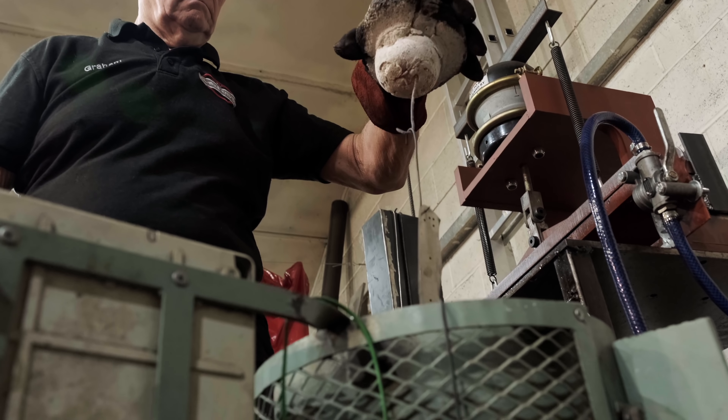To stress relieve, you heat the metal up to below that critical point, all the stresses relieve themselves, and it cools down. But if there was stress in there and it's now relieved, your metal's going to bend. You put it in for stress relieving — it comes out a bit more bent, or bent the other way, or maybe straight. If it's more bent, you bend it straight again, putting more stresses back in. I then heat it right up and quench it — it's bent again. It's not easy to keep them straight.